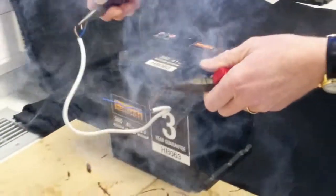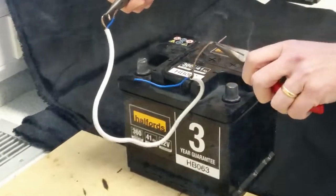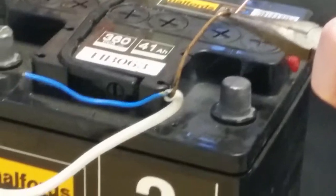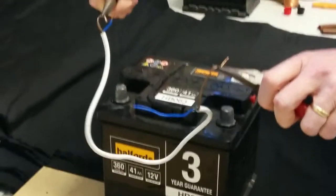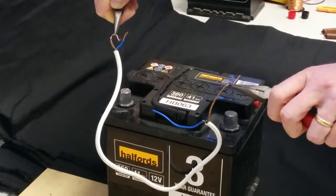Okay, that's genuinely not a good thing. What's happened there is that the very high current has vaporized the plastic, and what you heard was gas streaming out the end of the conductor. So that's what would happen if you short-circuited your domestic cabling without a fuse to protect you.